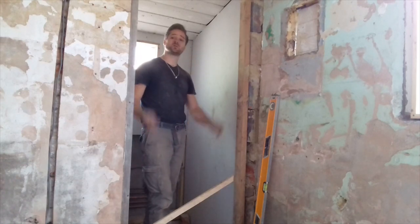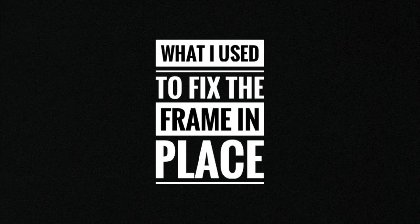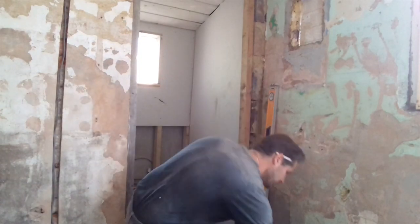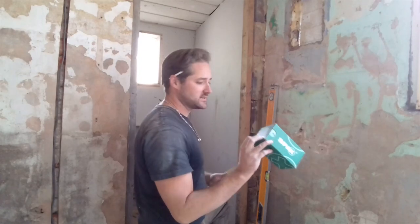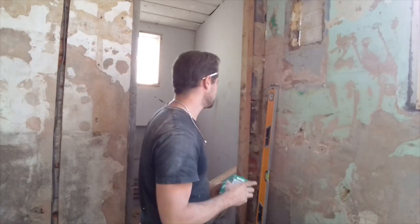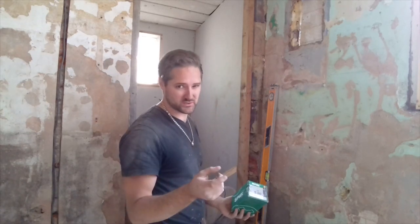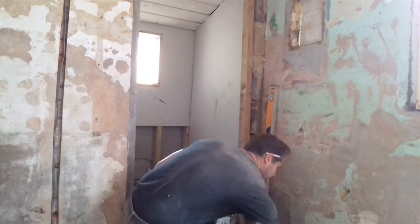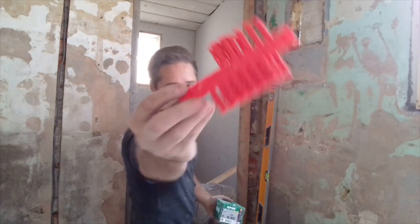Then at that point I will show you how to deal with the door liner. For wall plugs, you can go with the brown wall plugs — I just use these, they seem to do the job. I have used 5x80, which is massively oversized for that wall plug but none the less it still holds. That is why I like those particular wall plugs. You can get some real cheap ones that disintegrate, but these ones are a little bit more expensive and they actually look more robust.